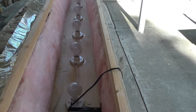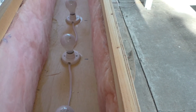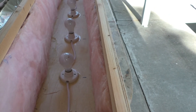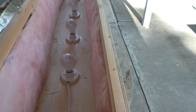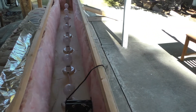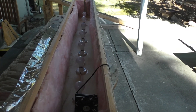The bases of the light bulbs I glued in initially with CA adhesive just to tack them in place, and then I put silicone adhesive around the base. The silicone resists temperatures up to about 600 degrees, so it's fine. This setup will get up to well over 200 degrees, which is way more than we need to cure our parts.